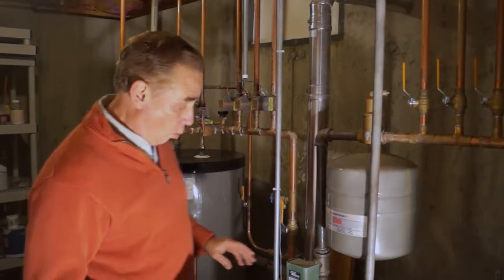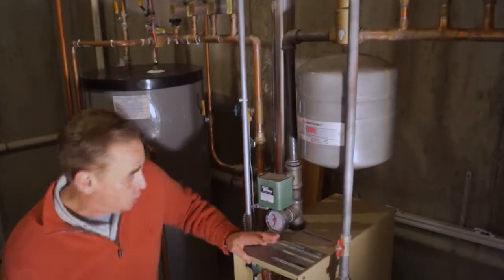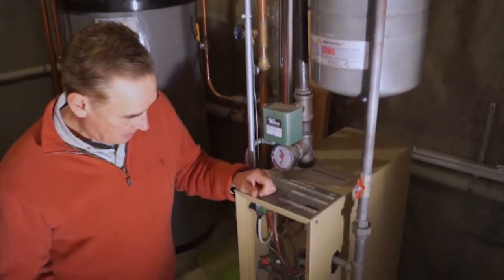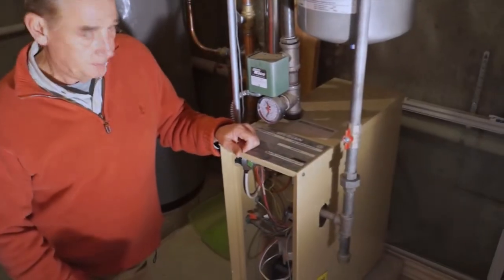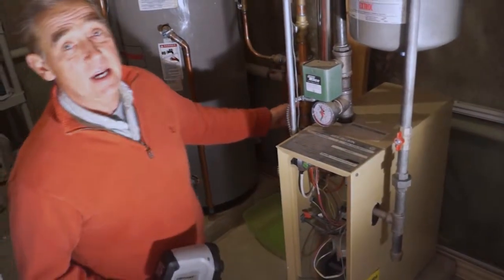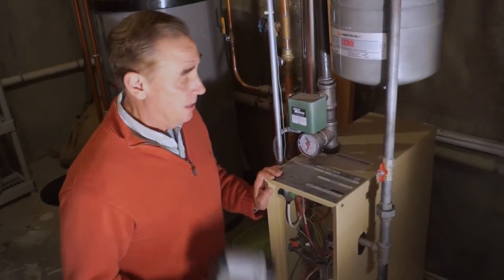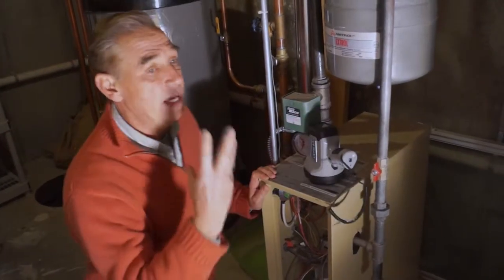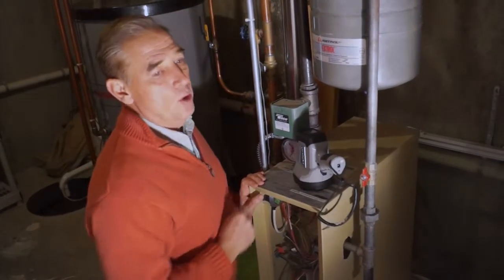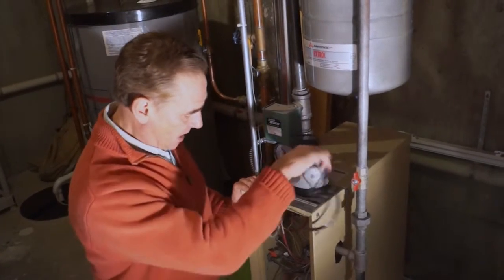During the course of the inspection, what I'm going to be looking at is the flame. So I'm just going to turn this on. The first thing that engages — you can actually hear the exhaust going on. What we're going to do is take out those gases, and then there's going to be a glow plug here. This is electronic ignition, so it's going to heat up. Gas will run over that glow plug — and you can hear it right now. Flame — it's going to fire up.